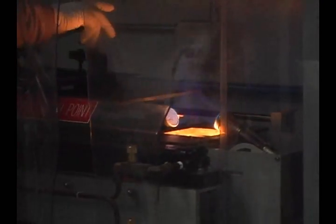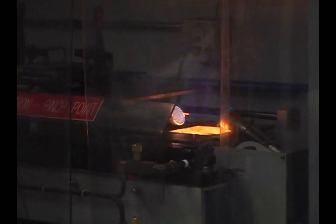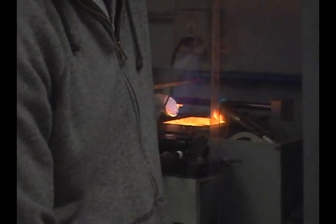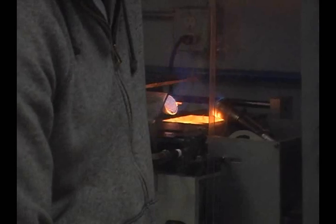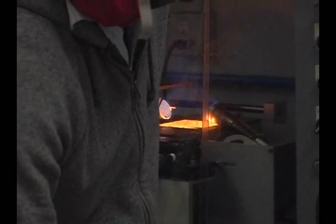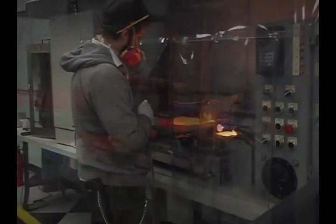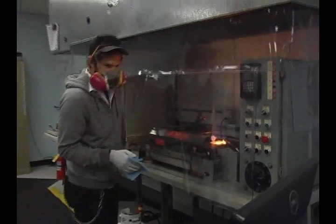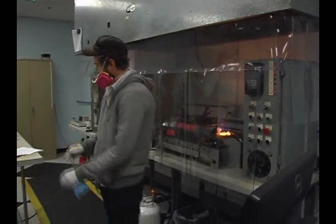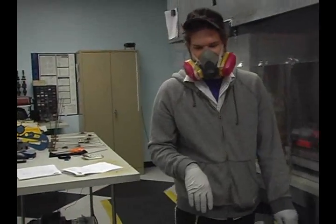The thermal load is a prescribed combination of direct flame and quartz radiant heat. The sensor basically reads the amount of heat transfer through the material to the sensor. In the case of the actual standard, it reads the time to a second degree burn to a human skin that would be wearing the garment. You'll see Aaron wearing a protective mask, and we have this hooded vent that's actually venting air out of the room. He's wearing that just as a precaution, just in case we occasionally come across something that doesn't meet the spec.